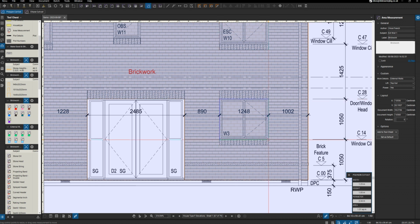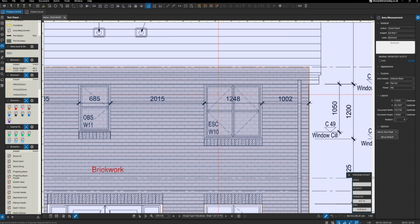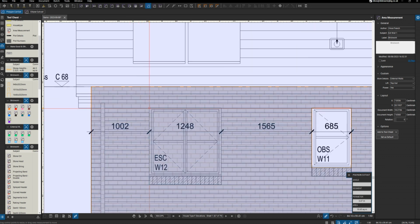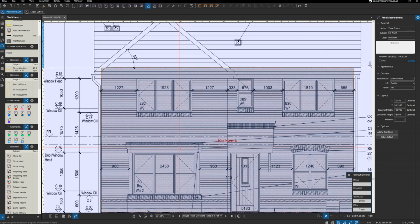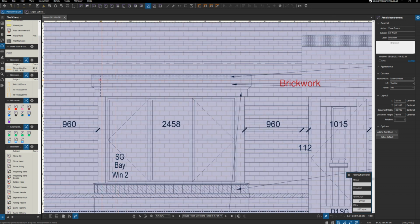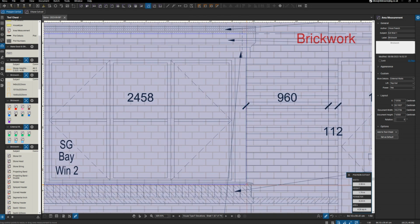By cutting these out, we're going to mark them up with something else in a minute, and from that, for each window, we get details like whether it's got thermobate or a window former, type of lintel, whether it's got a cavity tray above it, and weep vents. That's all taken from the information that's in our spreadsheet, which we merge all the details from this with later on. The idea is we do as few markups on here as possible, but generate as much information in Excel as possible.